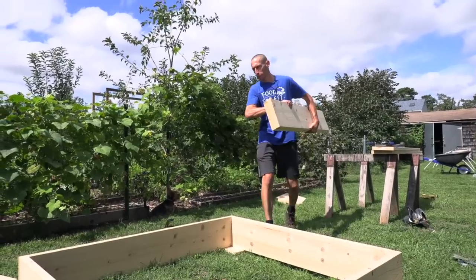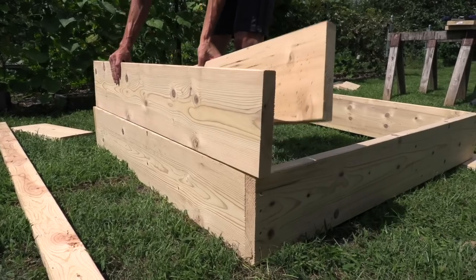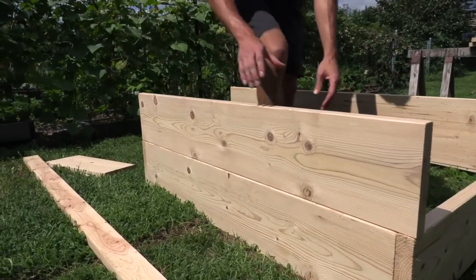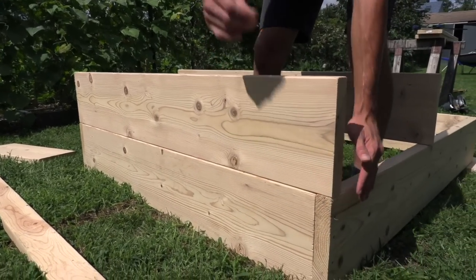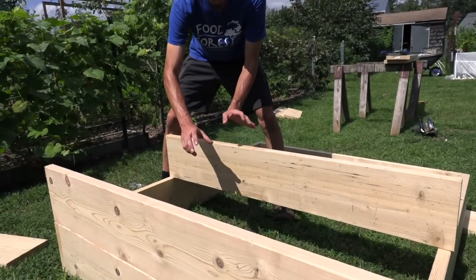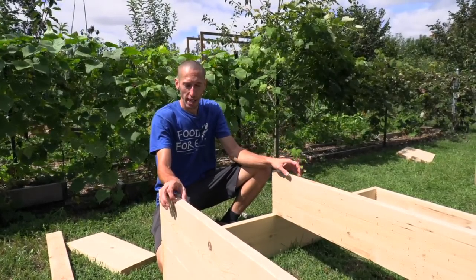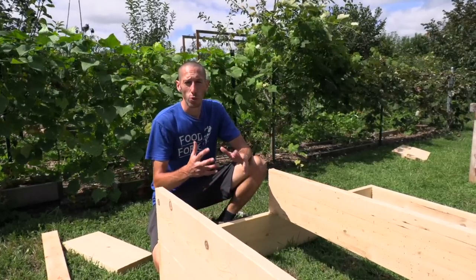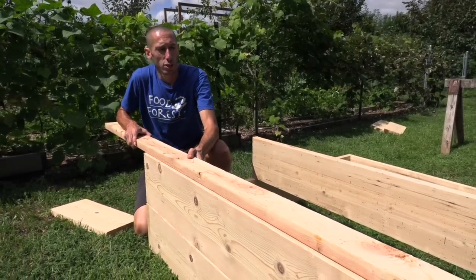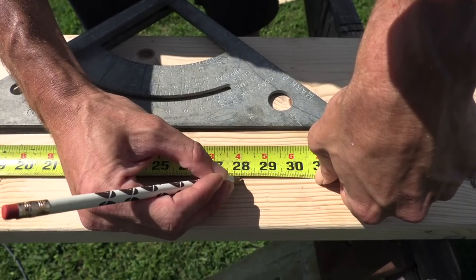We have both pieces cut at 55 inches. Let's throw them up here — this one goes in the back, this one in the front. We can see that overlap on the back side. Now we want the inside planting area to be 24 inches. Doing the same math: 24 minus three inches gives us 21 inches, then add back seven inches for the two rails, giving us 28 inches. So we need to make a center piece at 28 inches — let's mark and cut two pieces.